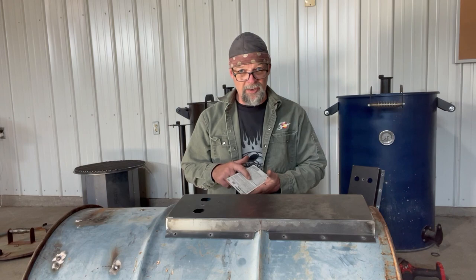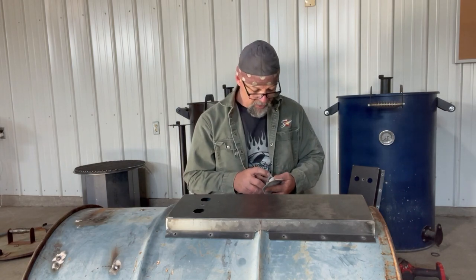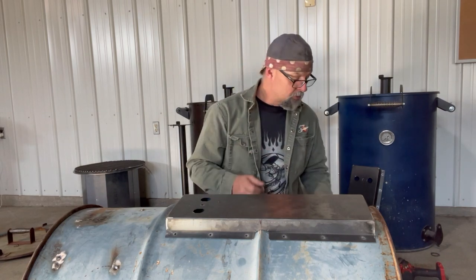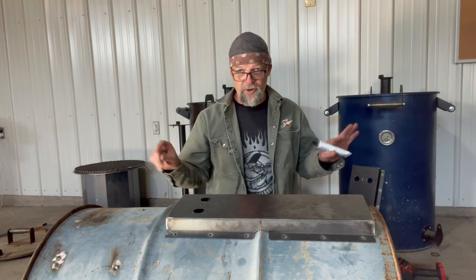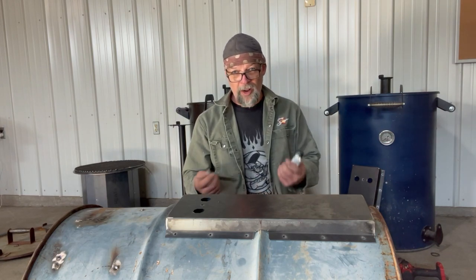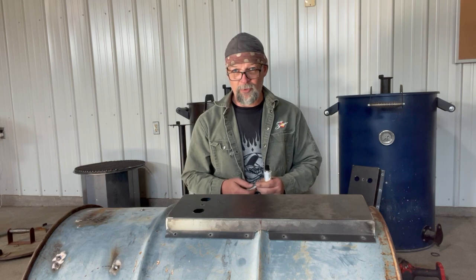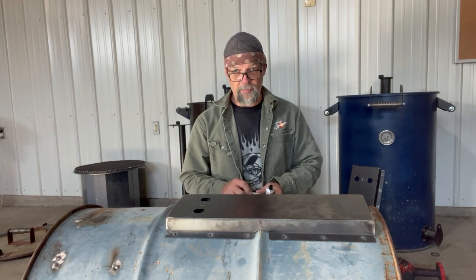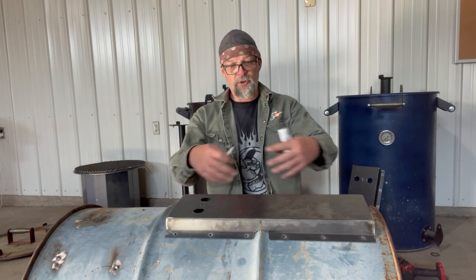For silicone, any flavor works. I'm of the opinion that food grade is just a thing they paid to put on the label. I'm going to use clear because the clear silicone will let whatever color is on the barrel bleed out. Now if you're painting this barrel, do not apply silicone until after you're done painting — silicone and paint do not get along. Paint will not stick wherever there's silicone, and if there's silicone there, it's going to cause fish eyes in your paint. If you're using the zip screws, that's a good thing — you can zip screw your part on, take it back off, paint everything, come back, drill the holes out, then use the rivets and the silicone later if you wanted.